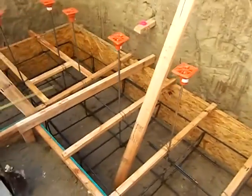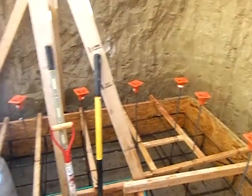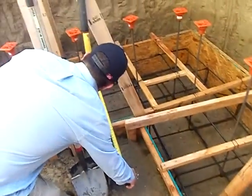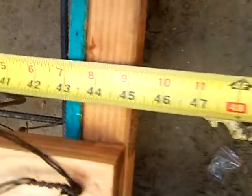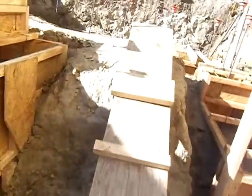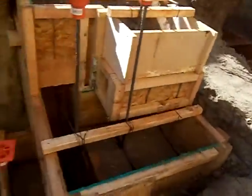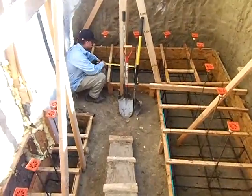Get a picture of the whole footing down here — kind of just slide your camera so the whole footing shows up. On this footing I am 43 inches wide. Can you show 43 inches on the camera with the tape measure? We're 43 inches wide. Show all the rebar in the video, then go up the ramp so we get a view up from the ramp.